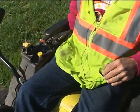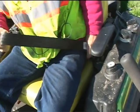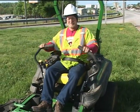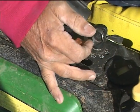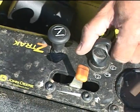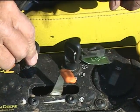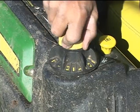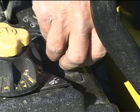When you're in the field and ready to start mowing, the first thing you do when you get on your mower is buckle your seat belt. Once your seat belt is buckled, you're ready to start. Pull your levers in, set your throttle to about half so the motor doesn't race when it starts. Then reach for the choke lever, pull the choke, turn the key, and the mower should start. Once started, release your handbrake, set your deck level to the desired position, turn on your blade, and start mowing.